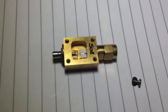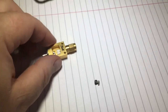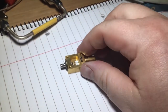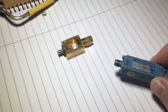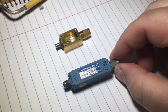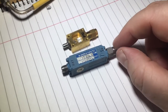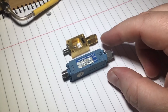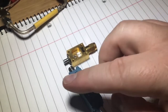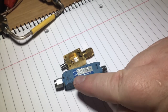We're dealing with fractions of half a millimeter, if that. I wanted to talk about the architecture of this pick-off diode, but because I don't think I'm going to be able to repair it, this — interestingly enough — is the same function but made by a different company. This is a wideband detector diode detector. If you watched the microwave goodness video where I went through all the microwave parts, I showed a few of these.